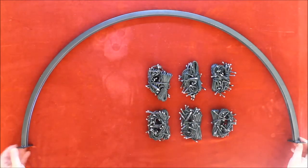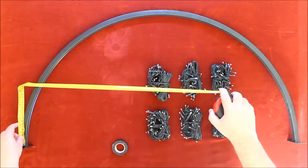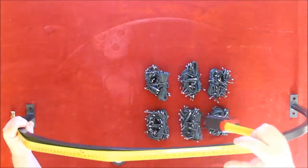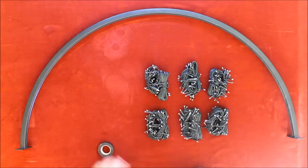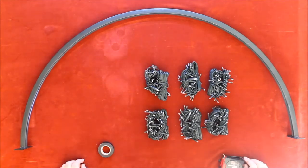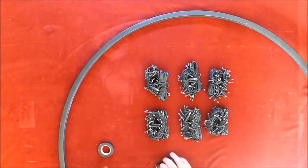Take the arch itself, get a tape measure and a roll of tape, and measure the whole length. That's 63 inches. Take the 63 inches and divide it by six — 63 divided by six is 10.5 inches. So you get tape and mark it out.